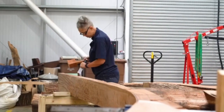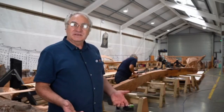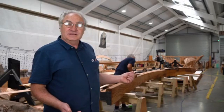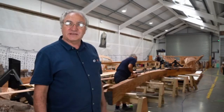Joe's working on the bow underlout. The underlout is the extension piece to the keel and the transition piece into the stem and the stern post. This is the forward end of the bow, and what Joe's actually doing is cutting in the bevel that the plank will sit against.